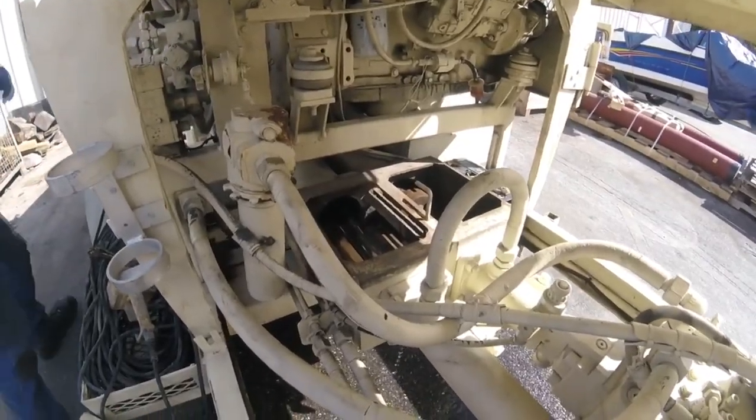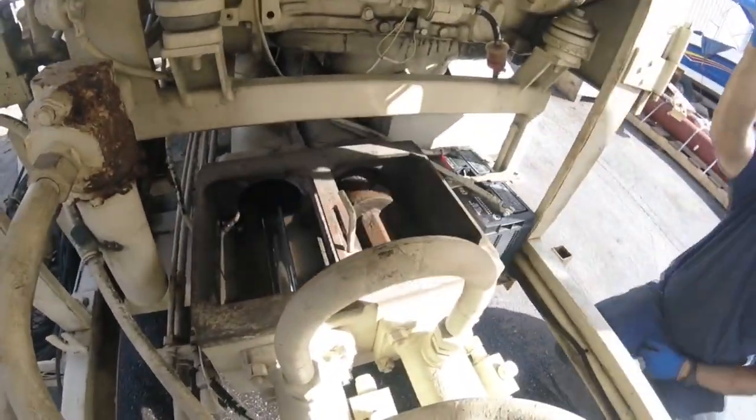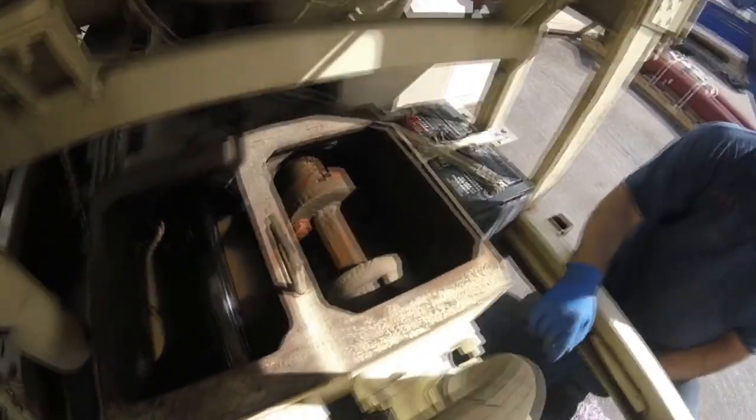You'll see where the dog bone is. Let me go over. You guys stay here and I'll go around here. Now, at the end of the job, when you're dumping the water, you're doing much more than dumping the water. You're checking for these four bolts here. They will get loose, especially if you add another piston cup, the rubber cup in the back of it.